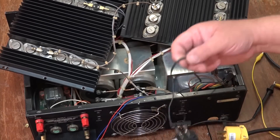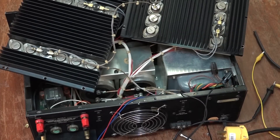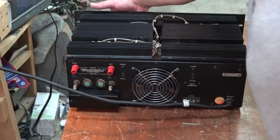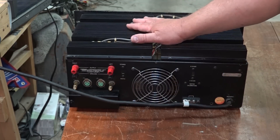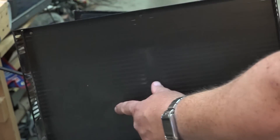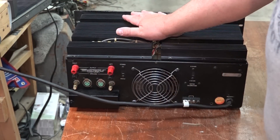The new adapter is tied to the switched line — this brown wire coming off the thermal shutdown switches — and the other side tied to the neutral. I'll get the adapter in place, remount the heat sinks, plug it in, and make sure the fan comes on when I turn on the power. There goes the fan — nice and quiet — and yes, we have lots of airflow coming through. When the top is on it forces the air across the heat sinks and out the side vents, so that fan running full time is going to provide plenty of cooling for this amplifier.